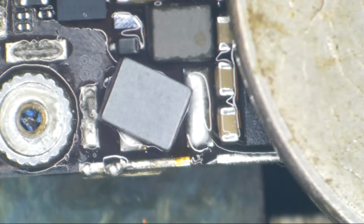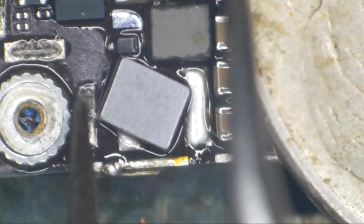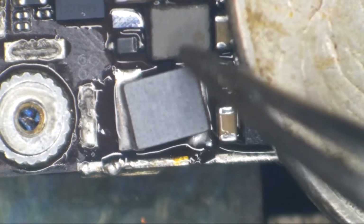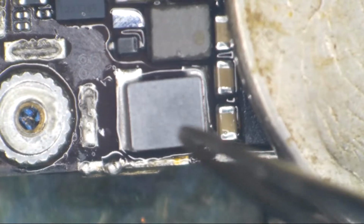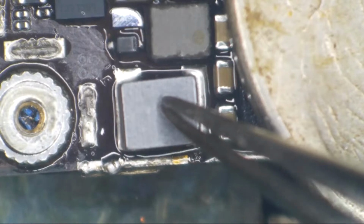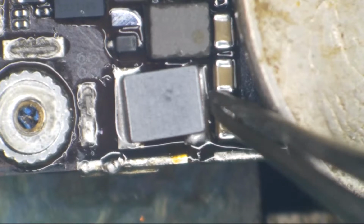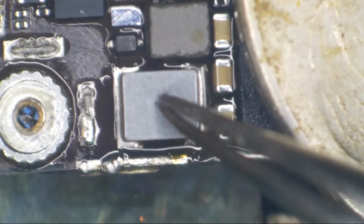I did a video on how to source components for board repair. It will show you most everything, except for how to find these coils. I don't think I included the coils in that video. For the coils, I went not only by the microhenrys and the specs, I actually had to physically measure the coil with a ruler under the microscope to get the right dimensions. I might come back and revisit that video one day whenever I can spend more time on YouTube.